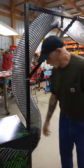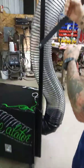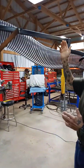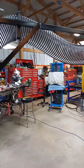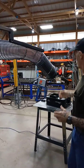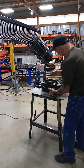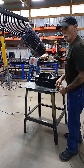My frame is inch-and-a-half tubing. I put a two-inch tube here so I can take the boom right out. The boom is totally adjustable — I can raise it up. It reaches out about six feet high. I figured if you're welding any more than six feet up, the smoke's above you anyway. I can adjust it anywhere I want. For the demonstration I've got it right about here — if you're welding here, this would probably be the distance you'd want it, and it's not going to come up in their face.